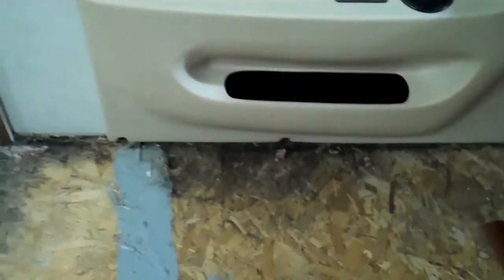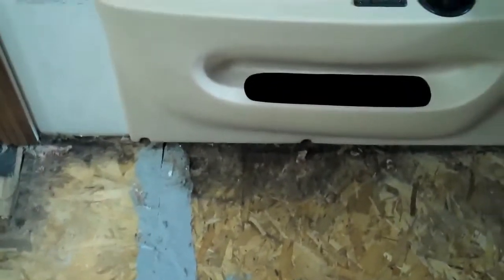Let me take you inside — I think they've got everything prepped and we're just getting ready to do it here. We're going to have to do a little bit of repair. A lot of people are surprised to know that when we go to take the carpet out or take the old flooring out, a lot of times we find water damage. If you look down here, I can actually push my finger through the wood right there. So we're going to have to take this piece out — that's really bad, probably just from the window leaking in. We have to take that out and replace that.